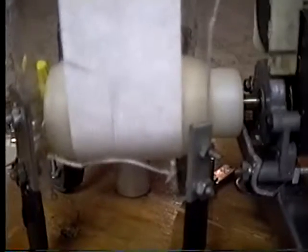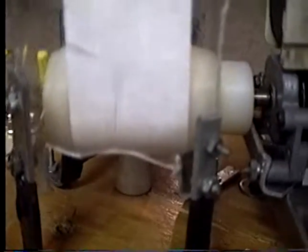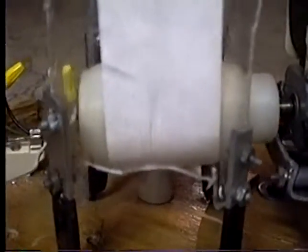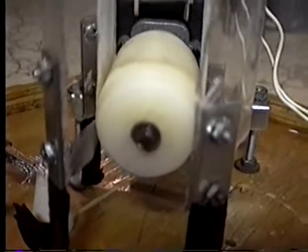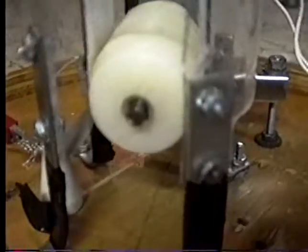I have a piece here to show you. We initially had the drive pulley on the base the same as the one on the pickup end, and the motor speed was actually too slow. A coworker had given us a block of nylon, round stock — I think the diameter was two inches.